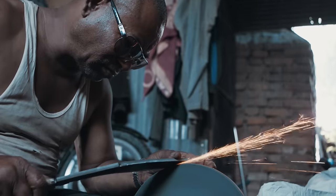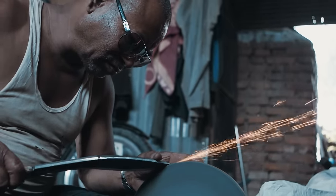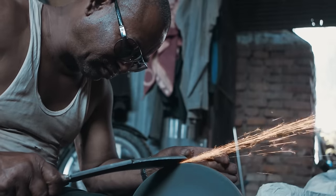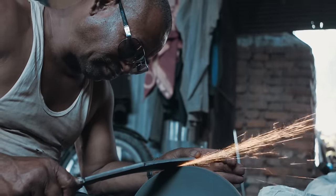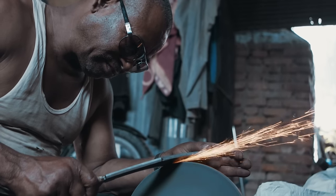Now, what is a burnt edge? Basically, a burnt edge is when they're done heat treating the steel and they go to sharpen it — they put it on their belt grinder and they're putting an edge on it — and they heat up the edge higher than what the steel was heat treated at, burning the edge, which makes for a bunch of issues.